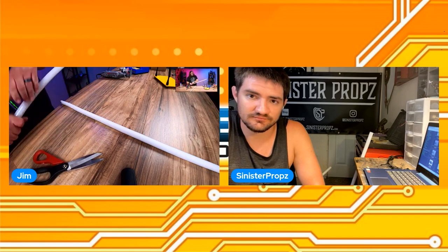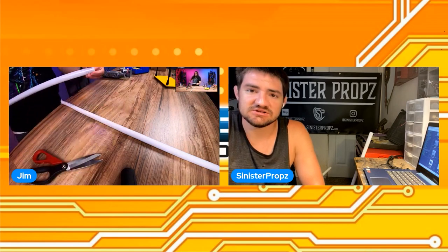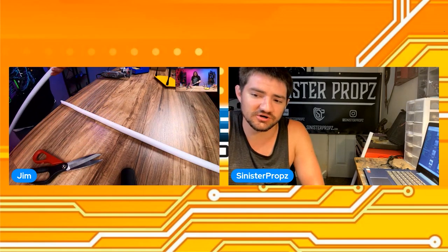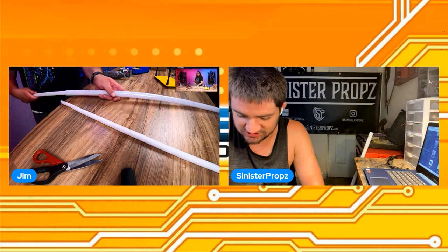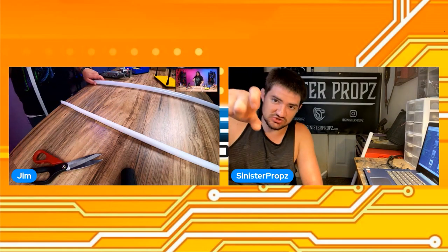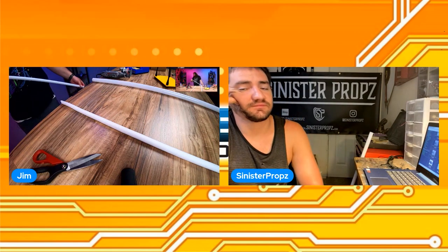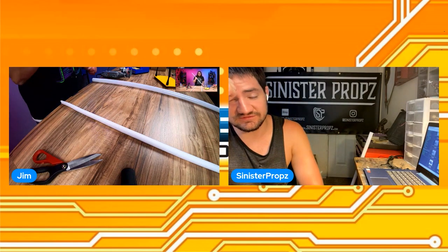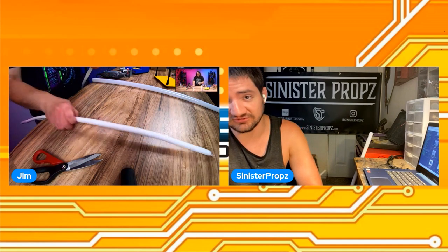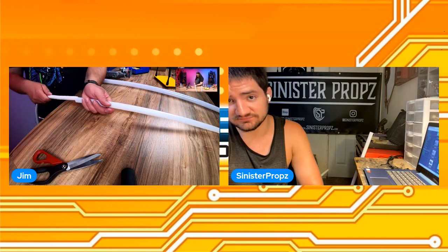So you want me to take the tip off too? Take the tip off. Yeah. Tip is off. Diffuser. Take the diffuser out completely. Feed the foam core with the NeoPixel blade into it. Okay. And like I said, twist the foam core slightly as you push it in there. If not, you could lose the NeoPixel down into the foam core a little bit. So just be careful. It should go pretty easily, actually, if you do it right.